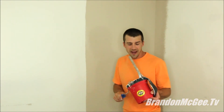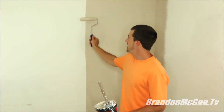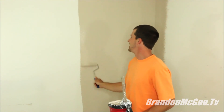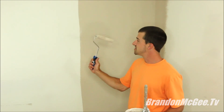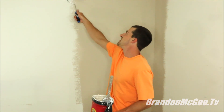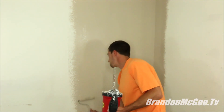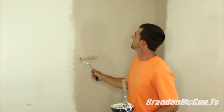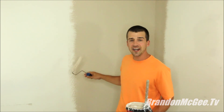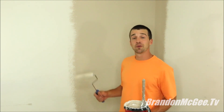If it's been a long day and you want to stop painting, here's a great technique to transition into your existing paint. Once you have paint on the walls, flip your roller around so the frame is on the outside of the unpainted area, then run the roller about halfway on that line you just created. That gives you a nice feathered edge to transition into later, so you won't get a hard paint line when you paint back over it. That's how you roll a wall with a mini roller.